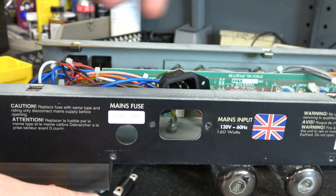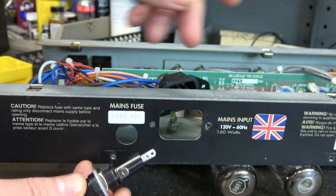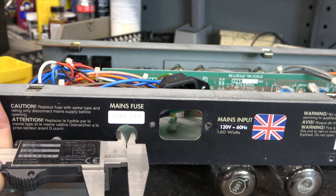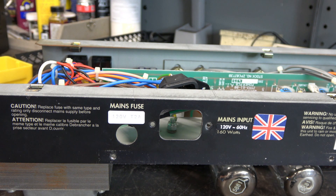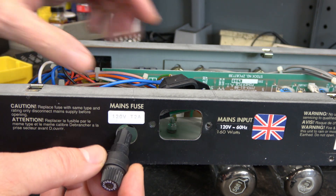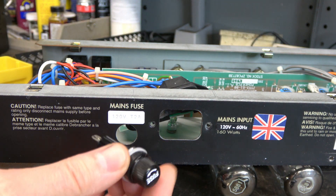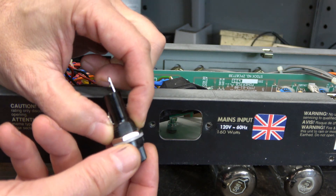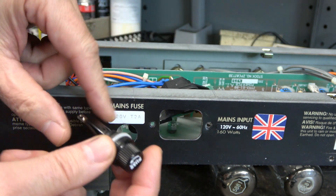Here's one thing that you've got to find to pull this off. The IEC jacks are easy to find but this fuse holder is a bit of a problem. If you take my calipers and measure this hole you'll see that it is not a half inch. A standard chassis mount fuse holder is a half inch diameter, so when you put it in here it's going to be a sloppy fit. But they do make another fuse holder, also for 3AG fuses, that has a 0.6 inch diameter — when it goes in it's solid as can be.